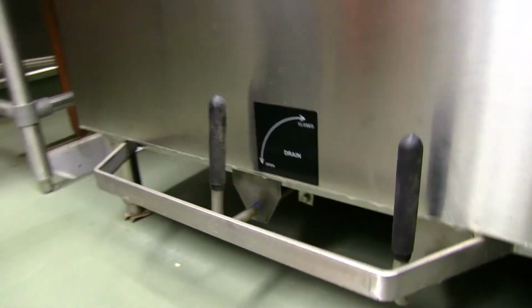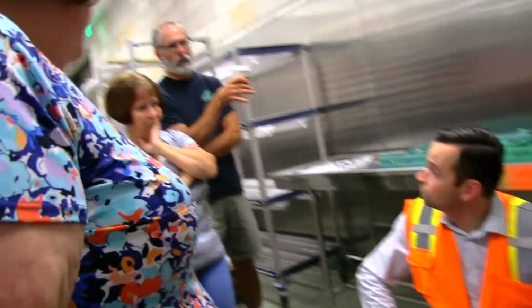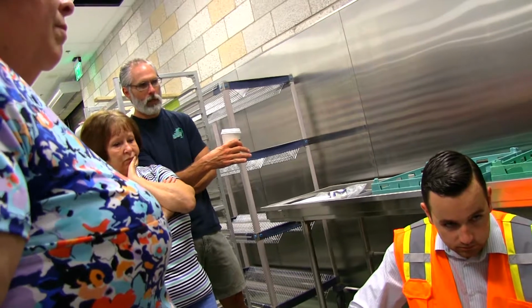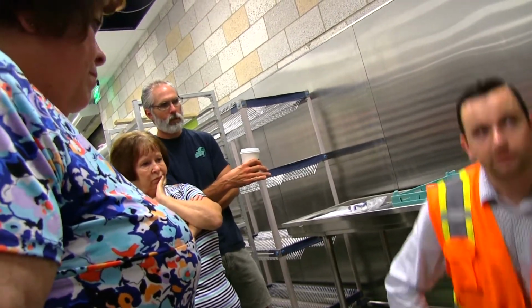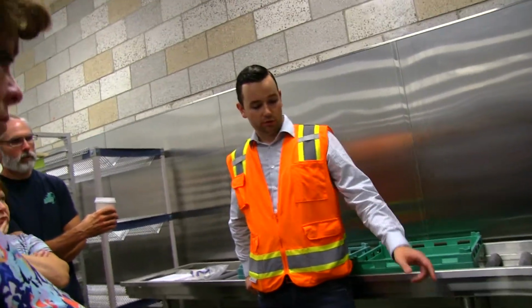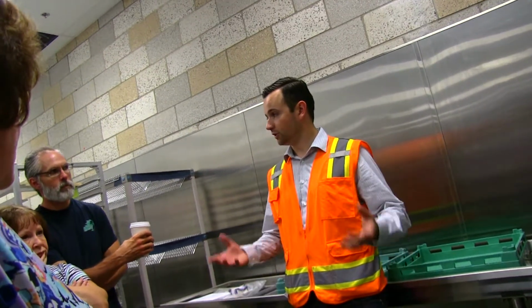Should it be off first? Yes. It should be off first. And these elements, once you drain, are the elements going to be dry and then risk from chlorine, or are they kind of protected? Great. So when you start it up in the morning, you want to put the drains closed again. It'll fill itself up, and then it'll start heating.